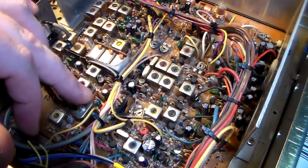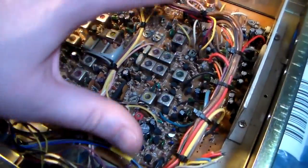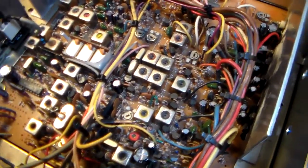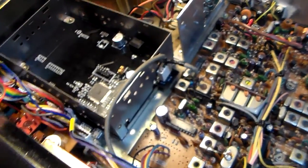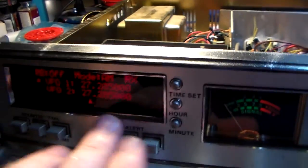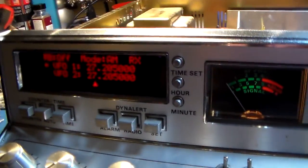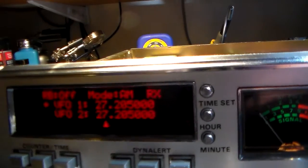This floats. So what I'm doing here is looking for the presence of voltage on the negative rail, because it's basically not connected. And when I see that, I know that the radio is off, and of course power down the microcontroller. Basically just put it into sleep. And when it goes to sleep, it blanks the display, basically holds the display in reset. I haven't really figured out if there's a way to tell this LCD module to go to sleep.